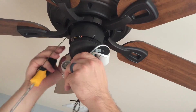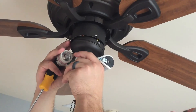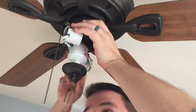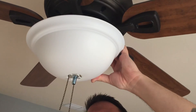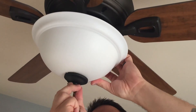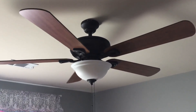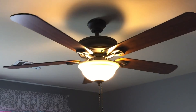Next, fit your wires in and lift the light up, making sure all your screws line up with the holes. Then unscrew the cap on the bottom, guide your wires through the hole in the globe, and slide the cap back up. This particular cap has a center hole and another small hole for the fan speed chain to go through. Screw the cap back on and you are ready to test. With everything hooked up, I turn on the switch closest to the door and the lights work; turning on the switch farthest from the door, the fan turns on.